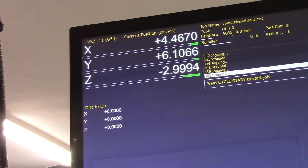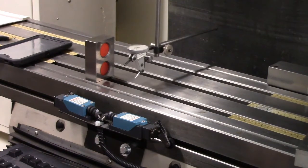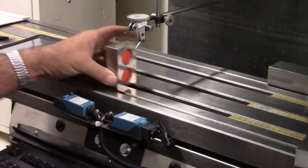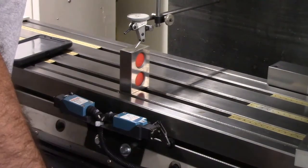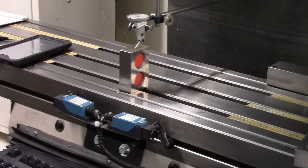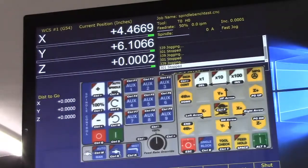So we get to do this all over again — let's see if we hit the mark. Alt-J for the jog display, Control-I incremental, then Control-F to get up there a little faster. Going to control-I incremental — super close right now, going into thousandths, creeping up on it, then going into tenths. Looks close. Going into our display and zeroing our Z-axis. Get rid of the jog panel — F1, part, X, Y, Z — zero Z.